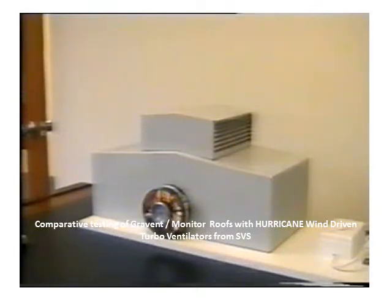The blower has been turned on and one can clearly see the blades on the anemometer are starting to turn. The blades are turning anti-clockwise, and this is indicating that the jack roof is actually back drafting with the wind hitting it directly front on.